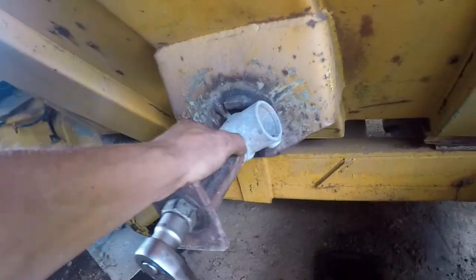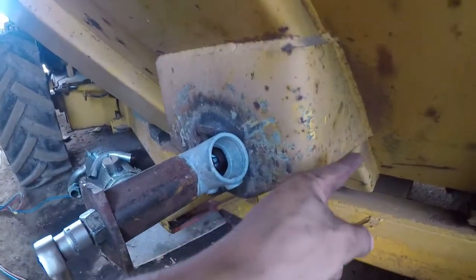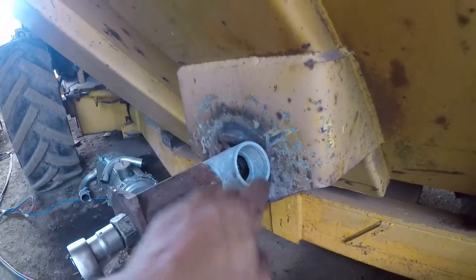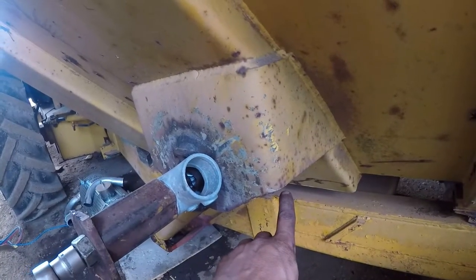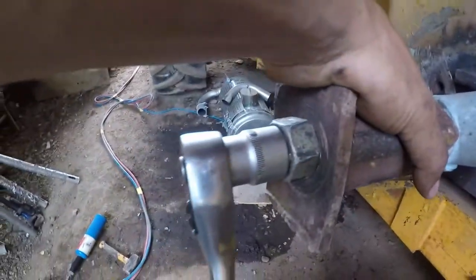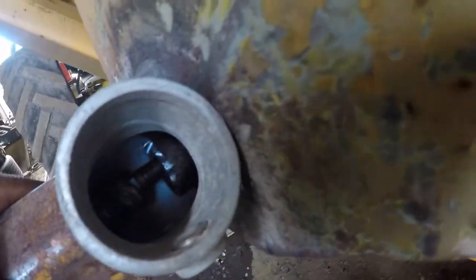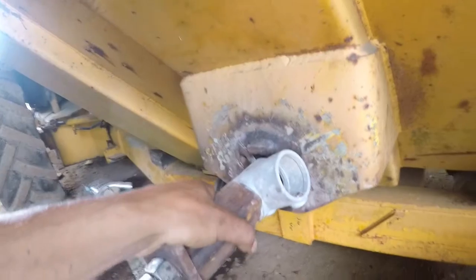Anyway, I'll try something different, because I got these holes in the pin. I drilled in quite far, about 2-3 inches. We've got 6 holes around the middle. So if I heat this up red hot and pour some water in there, it cools down the pin itself quickly, and I just start winding on that, and we'll see what's happening. I got it out like 15 mil so far, but that's 2 days work, 15 mil. So, yeah.